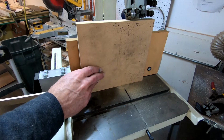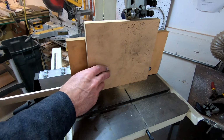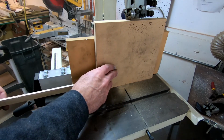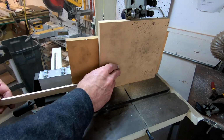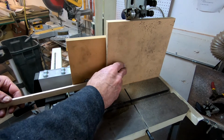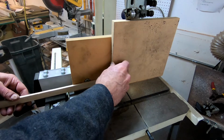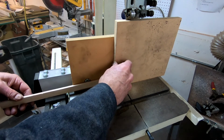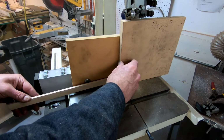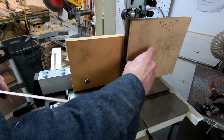When doing very, very long cuts like this, it's very difficult. When I started, the first veneer work I ever did, I used a half-inch kind of regular steel blade, and when it was perfectly sharp and perfectly adjusted, I could actually get a decent cut. But if it gets a little bit dull, especially on one side, a little bit out of adjustment, it will make the most horrible out-of-control cut you ever saw.